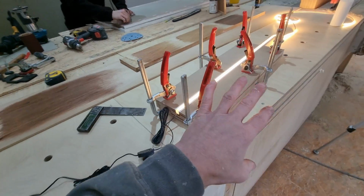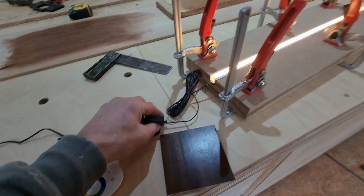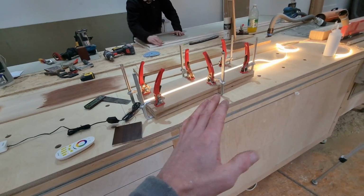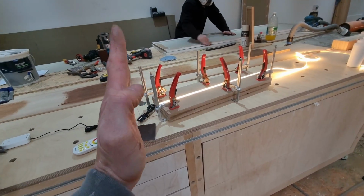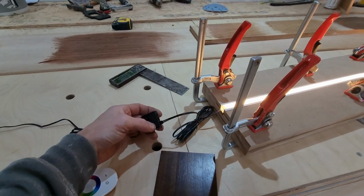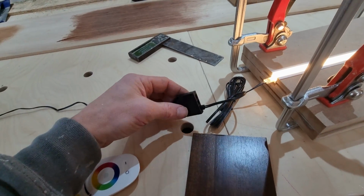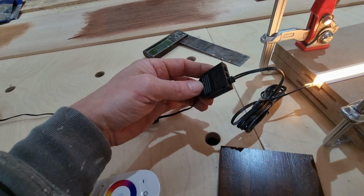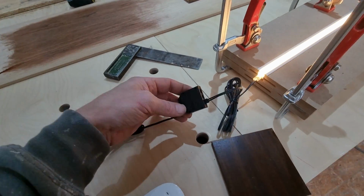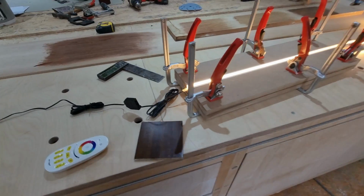Once the shelf is actually made and you are assembling it to your carcass, you can disconnect it from the splitter part, okay? Fix your lights all up. You'd have all your shelves made ready to assemble up to the sides of the carcass. You would just then feed these small connectors through, not that big connector through, okay? That's the way I see it, and that's the way I would do it. So this connector is ever so slightly smaller, but still allow yourself 8 to 10mm, I'd say, to get that through and pull that cable through.